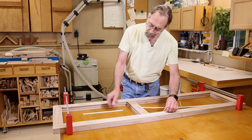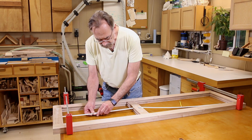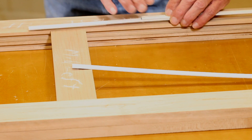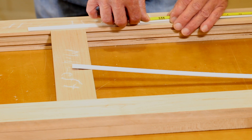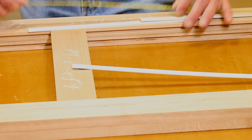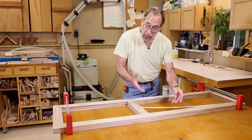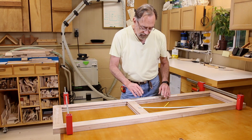The bottom one — I'm going to use these two short pieces here. Put one in the groove there, one in the groove here, hold that tight, make sure I'm roughly parallel to the two styles, and make a mark. Pull that out and do the same thing: measure from end to end with those two pieces held in registration where my mark was. And that is 22 and 5/16 inches. Now I'm going to take the 22 and 5/16 and the 33 and a quarter and reduce those two dimensions by a sixteenth of an inch to give me the same wiggle room I have in the side-to-side dimension.